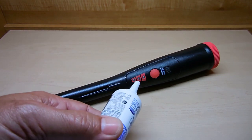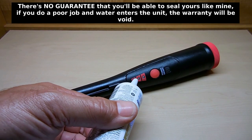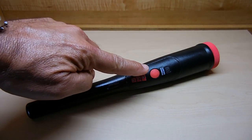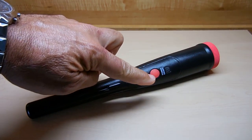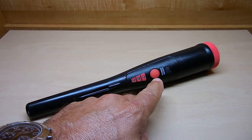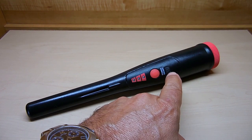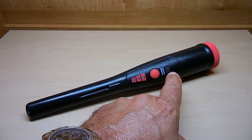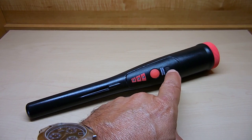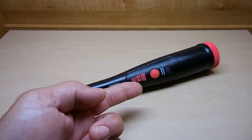When cutting the tip, make sure it's big enough to place over each LED. Force it over the opening, hold it tight, and squeeze — the silicone injects around each LED. When done, smooth with your finger, wipe with a paper towel, and smooth again quickly. Don't wait too long or it'll look ugly. The red button needs no sealing. Over the speaker opening, I injected black silicone about an eighth of an inch deep and smoothed it out, then allowed everything to cure for 24 hours. After retesting, there was no more pressure leaking through any openings.